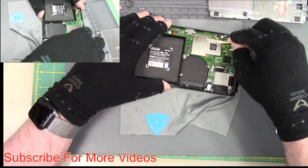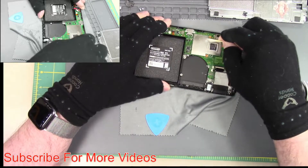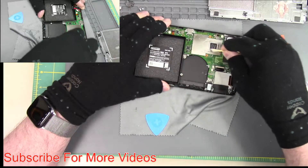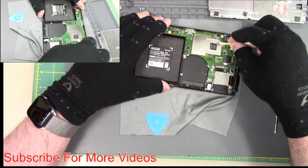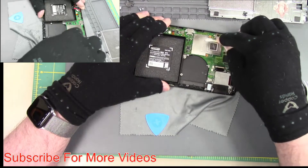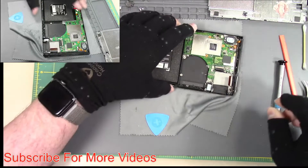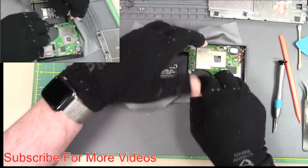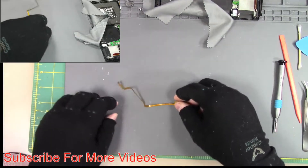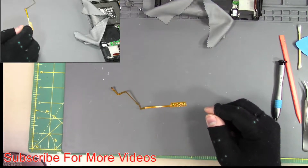The thermal pad does work to dissipate heat but it does tear that copper off, so I need to get a new piece of copper for that. I'll make another separate snippet video for that. Let's set our switch aside and see if we can test this power button — I'm going to bring the scope in so we can take a look.